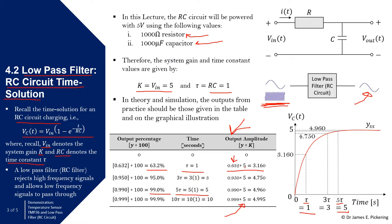These values depend on what you're looking at. I mentioned we won't go into too much detail on the relationship between temperature and voltage, and what the Arduino is doing to get a temperature value. In this case I've stuck to voltage, but these values could represent temperature — the maximum temperature or whatever the voltage gain value is. It doesn't really matter: whatever the gain value is, it's just a multiplier of the final value, and it would still take exactly the same amount of time to reach the final value of the system.